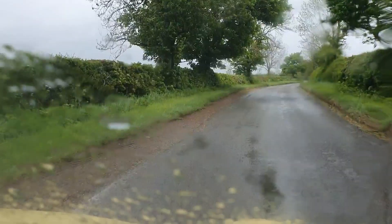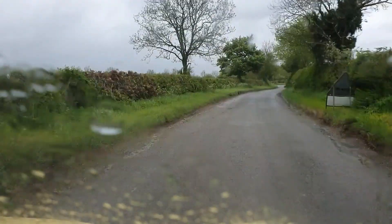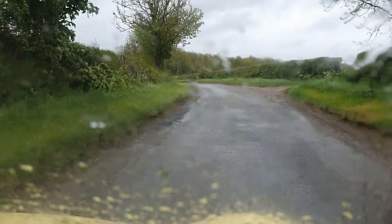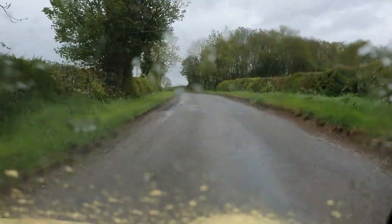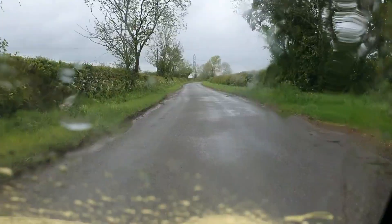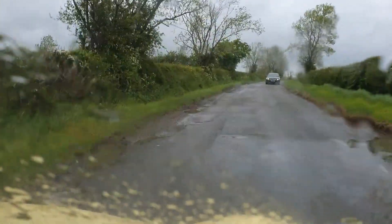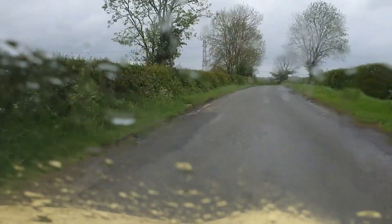Here we are on country roads now. It doesn't perform too badly to be honest — in Y, in star, it performs a little bit better than the standard G-Wiz motor, just a little bit. I think on flat main roads I will be capable of hitting 50 to 60, looking at about 45 to 50 up a hill, which is okay for the G-Wiz.